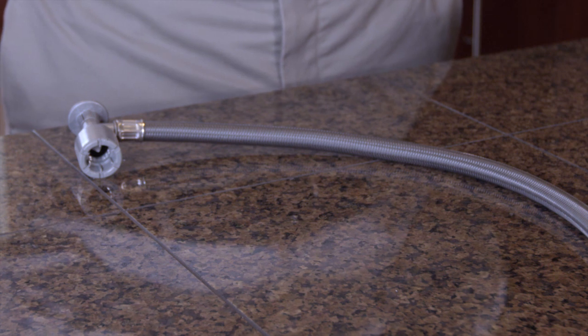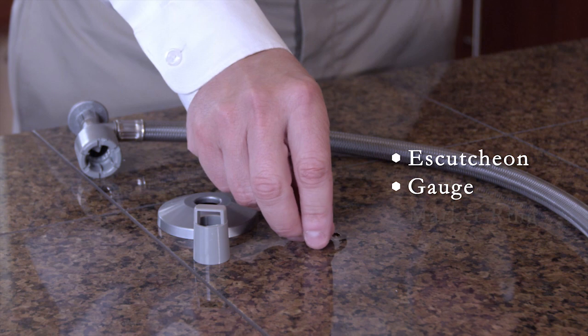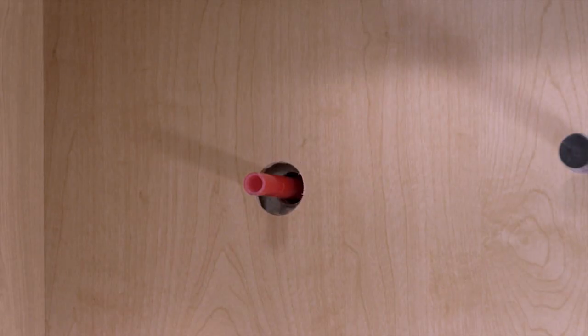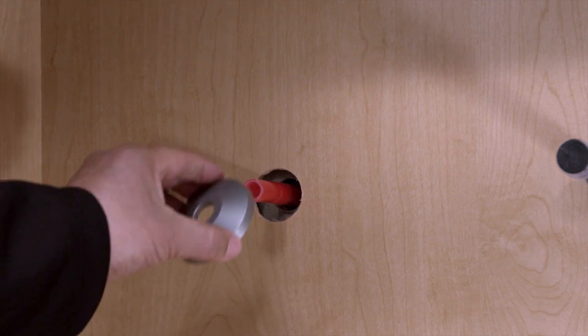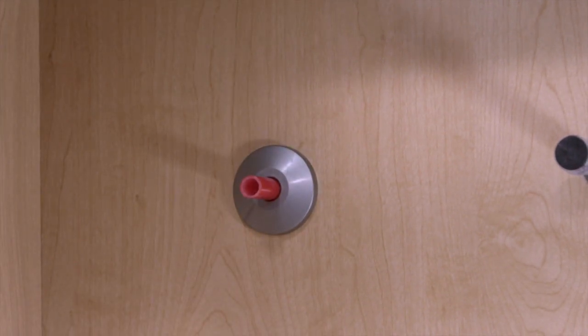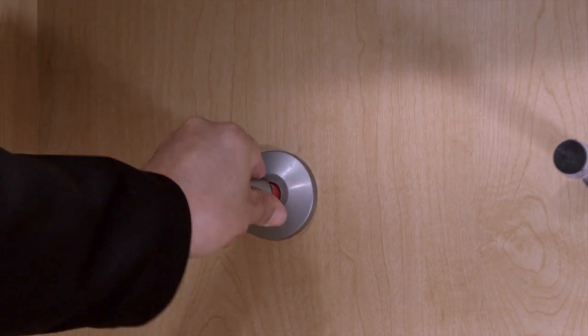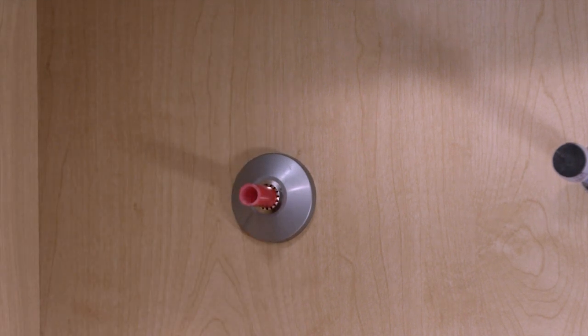Each Accor valve contains an escutcheon, a gauge, and a marker ring. I've already installed the dishwasher kit — now I'm going to install the angle stop. First step is to prep the pipe, making sure it's clean and free of debris. Then we will slide on the escutcheon until it's flush with the wall. Place the marker ring on the two-inch stub out and use the gauge to push it down one and a quarter inches. This is a great visual marker and also prevents the pipe from moving into the wall.